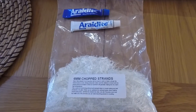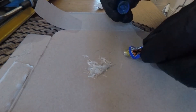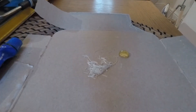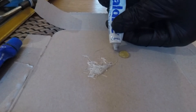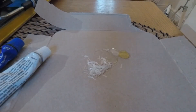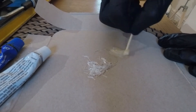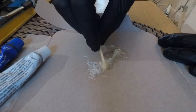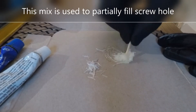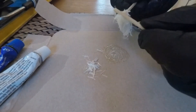The next step is to make up the mixture of the fiberglass strands and the epoxy resin. I'm just gonna start off with this amount of fibers and then add some araldite — so that's the hardener — and an equal amount of the resin. Then I'm just gonna use the back of a matchstick to mix that up so it's all the same color, then drag a few fibers into that mixture, give it a good mix and get the fibers all wet. Pretty sticky.